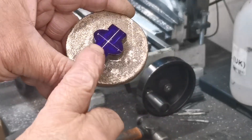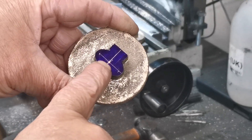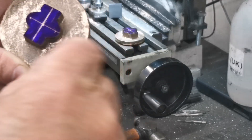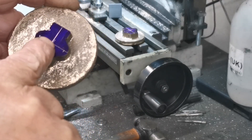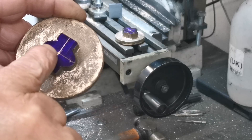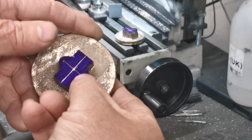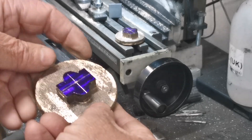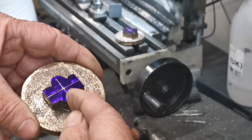I've marked out the center hole there — that will be where the piston rod goes through. I'll drill that, then drill the two stud holes, and then machine from the center out to the overall size each way.